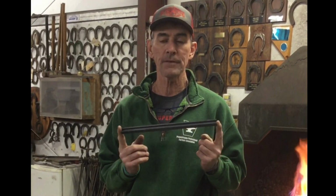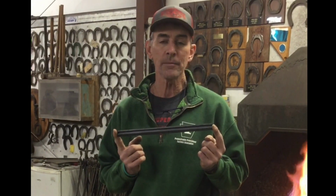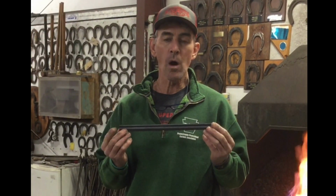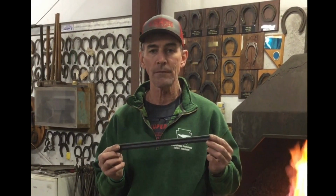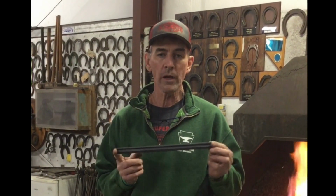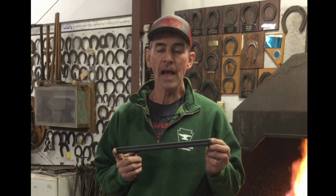We're going to do the mail-in shoe for the AFJ that we judge at the summit, and it's made out of 3/8 by 7/8, 13.5 inches long. It is punched for 7 nails, it's quarter clipped, and it's got a diamond toe in it. If you want more information on this video, you go to the AFJ for the mail-in shoe and you'll see all the specifics on it. We just got a few pointers that we're going to show on how to make it.